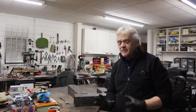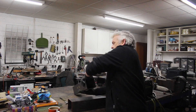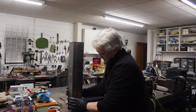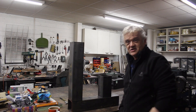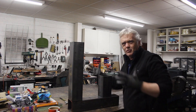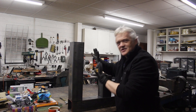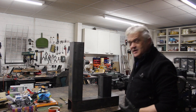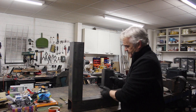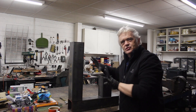A lot of the advice has been to go with something called a J-tube. A J-tube looks like this: air feeds in here, we drop our fuel here, and this is the chimney. The whole thing is square, which is cool because we can now put jackets and insulation around it really easily. We need to cut a hole here to feed the fuel and cut a hole here so the exhaust can come out, blank that off, and put a drum around it.